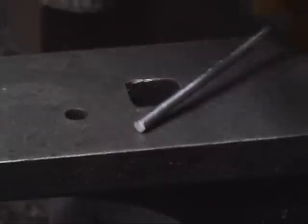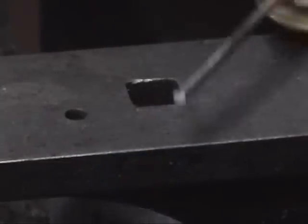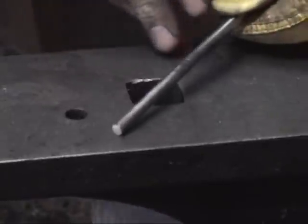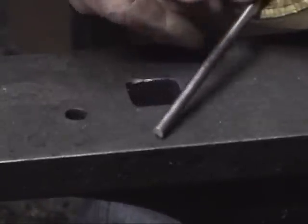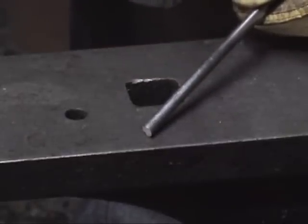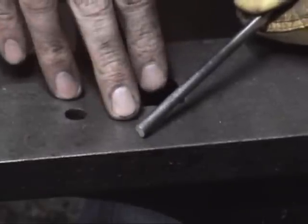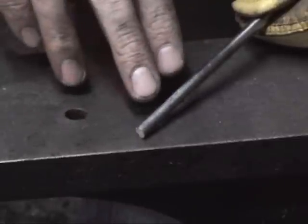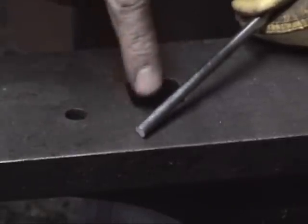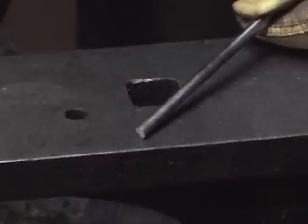And what you'll see, hopefully, as I do this, is I've got a butane torch here that we'll be using. I don't need the exhaust fan anymore, so hopefully we don't have to yell at each other anymore. As I heat this, hopefully you'll see the color of the steel change. What's happening is the external part of the steel is oxidizing, and that causes a variation in the steel structure on the outside, and it causes the steel to change color. That color can actually indicate temperature to us.